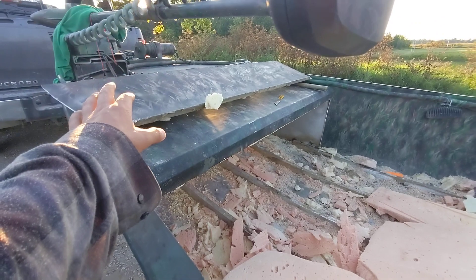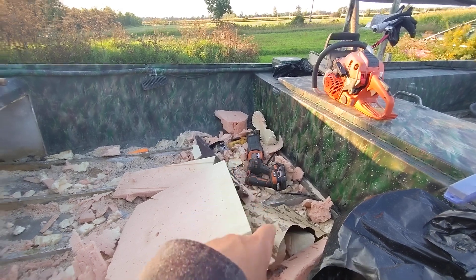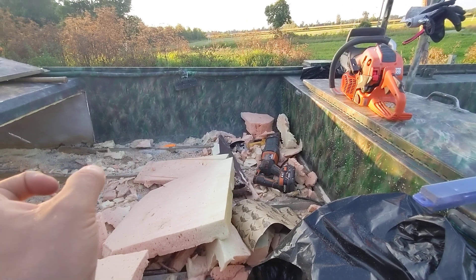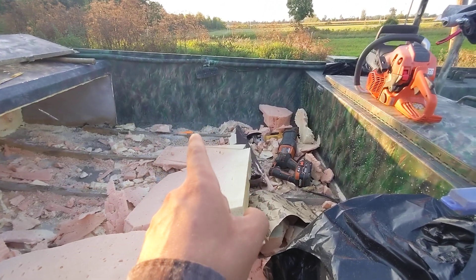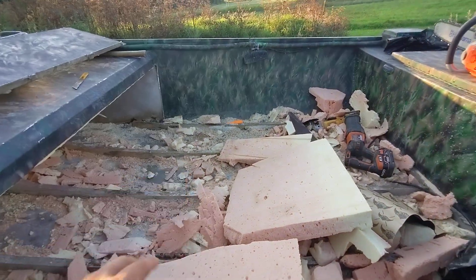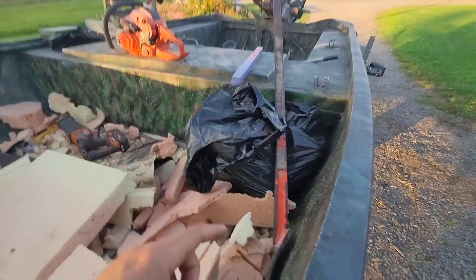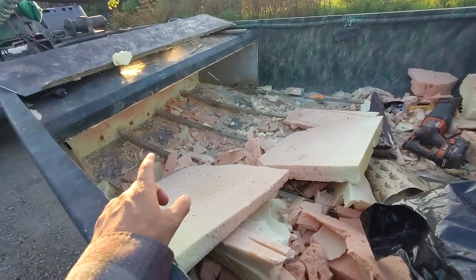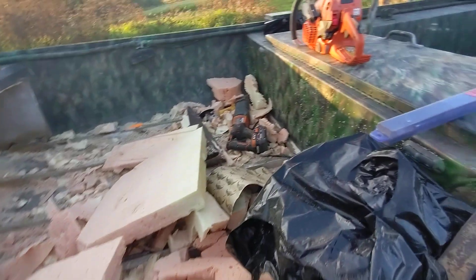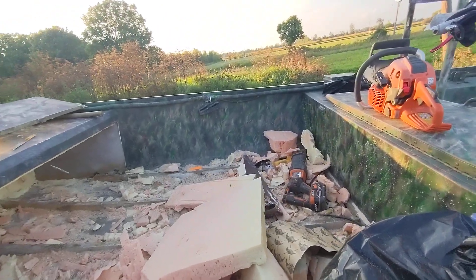This section was welded in - I cut it out using an angle grinder with a cutoff wheel, then finished it off with the sawzall. I was using the sawzall to cut the foam and prying it out with a pry bar, but it was very difficult getting only small chunks. So I went to the chainsaw - a 20-inch bar with a felling bar to pry out larger chunks. That's how I was able to get nice big chunks out, and it worked amazingly. I would highly recommend using a chainsaw.